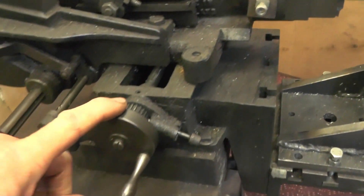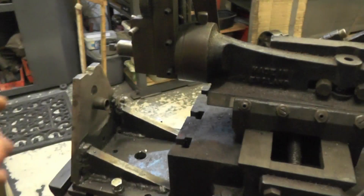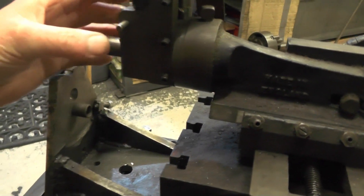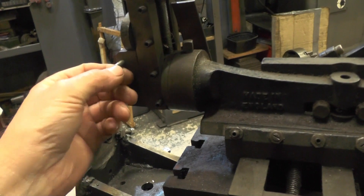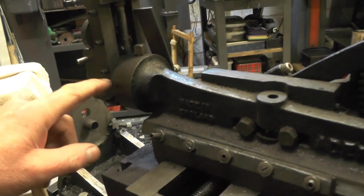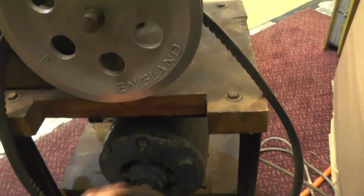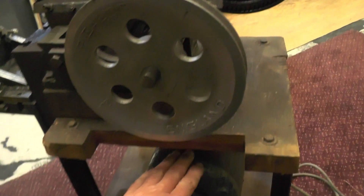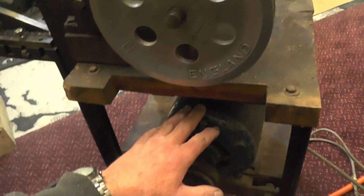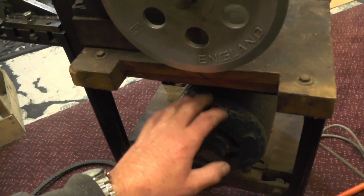It's got an auto-advance feed mechanism on it. Things like the clapper box have got a big pivot pin stuck through as though it's been chopped off with shears, and the Gibbs screws are all stuck out too far. The motor fits underneath the bench. I'm going to get it wired up and get a proper belt and try it. If that motor doesn't work I've got a plan B, though it's not quite as powerful.